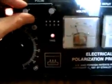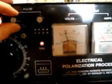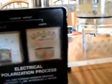As you bring the plates closer together, current is still down under around 5 amps or so. We can adjust the pulses — just by varying the frequency, you can change the pulsing. You can see the effects on gas. We'll turn the gas plates all the way out. Production should slow down as well, and you can notice the amp meter drop. The volts are holding steady at about 55 volts.